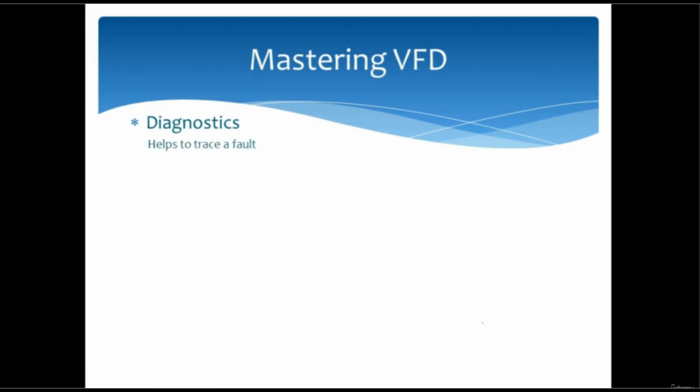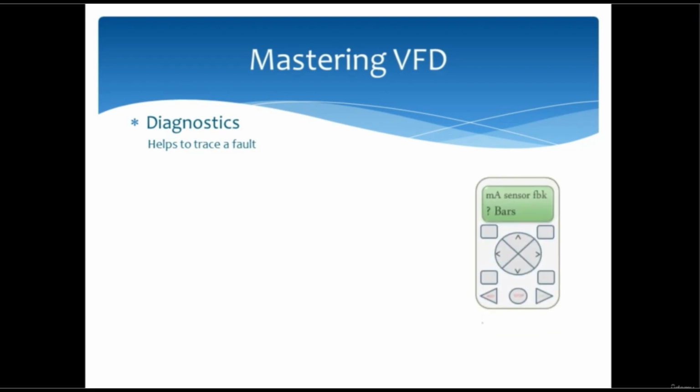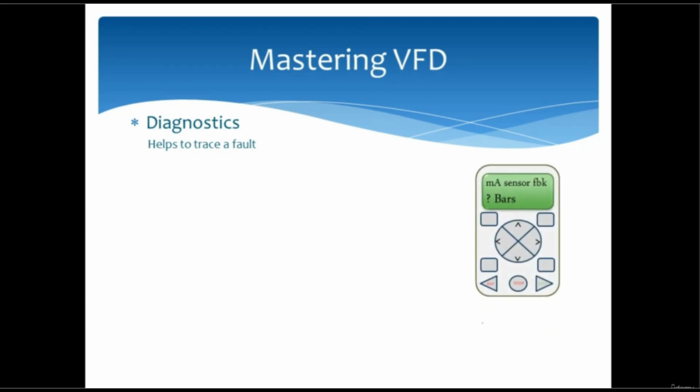Diagnostics in a device or diagnostic method is simply there to trace faults, or it can be used to trace our circuit. Which means if I have a pressure sensor and I doubt whether it is generating a signal or not, I can simply go to the parameter which can show the signal received, which will be either in milliamperes or voltage, or I can see it as a pressure indication. This way I can check easily without the need to open the connection and check with a digital multimeter. So this is diagnostics by monitoring parameters.